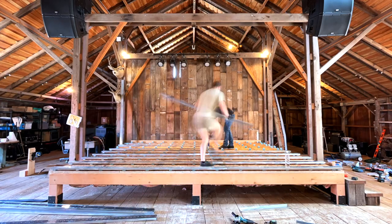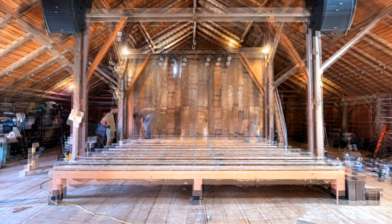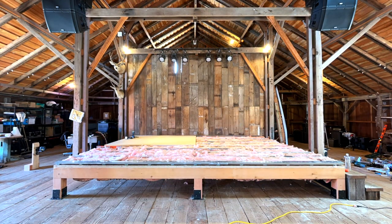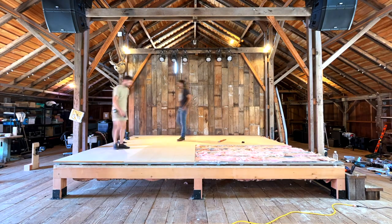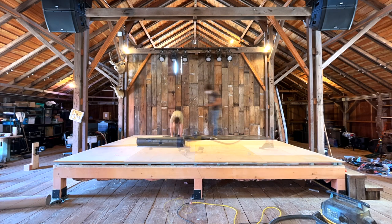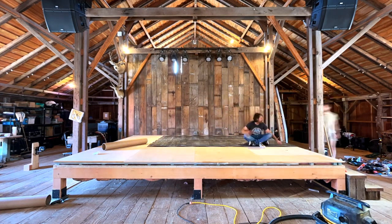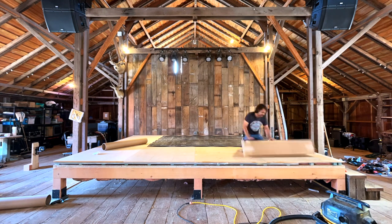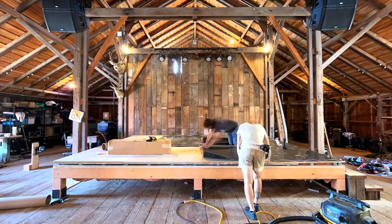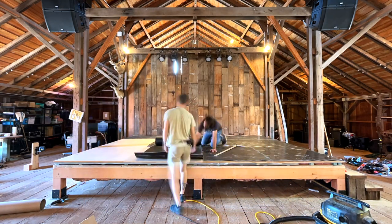These C-studs provide a slightly higher isolation performance spec, while also giving us ample room to screw in the top layers of the deck, starting with a layer of 3/4 inch MDF. After the MDF was a layer of 2 pound per square foot mass-loaded vinyl. This stuff is incredibly heavy, and along with the MDF provides a ton of just sheer mass to the stage.